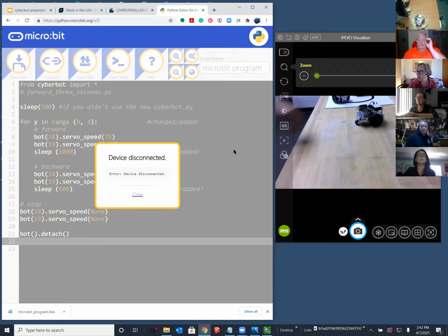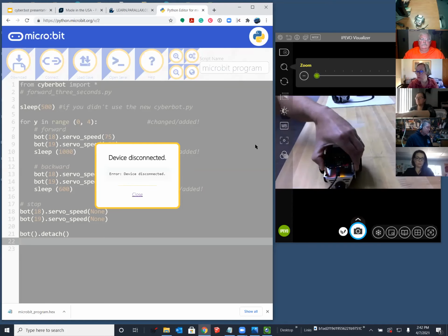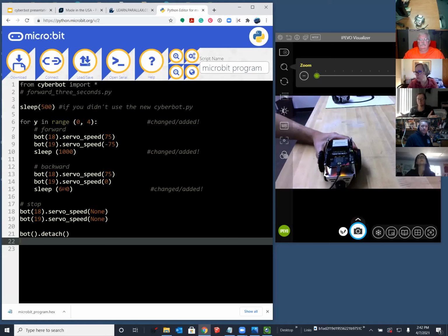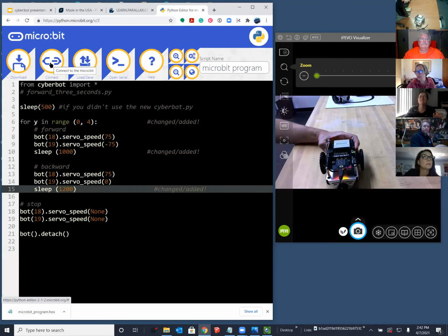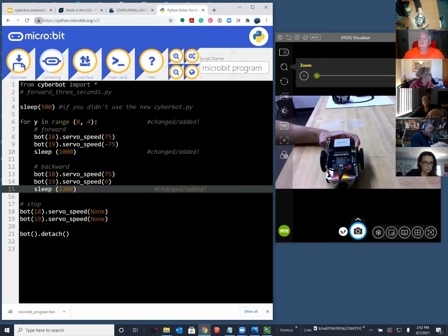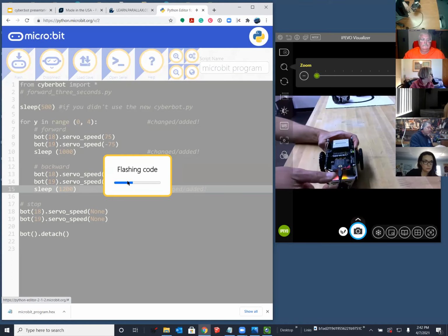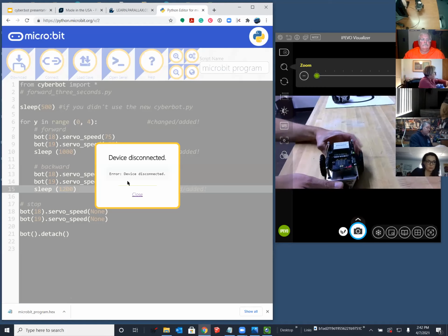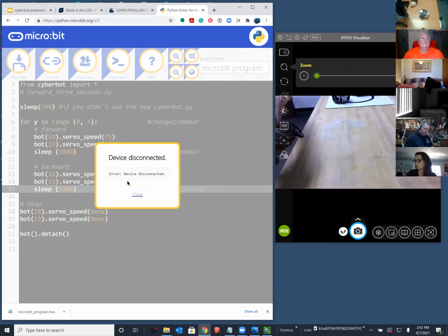Okay, I'm not turning enough. I think I need to turn about twice as much. So I'm going to change on my side that 600 to something like 1200. And then I'm going to flash again. And this process of changing, flashing is exactly what you'll do in class. And it's a great way to just evolve the robot to work really well. I almost got it about right. I think the magic number might be more like 1500 or so.